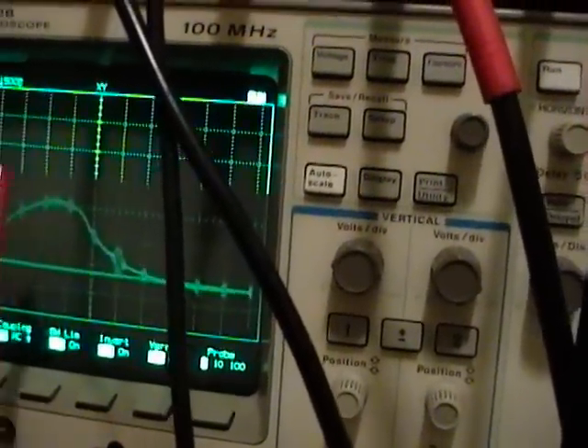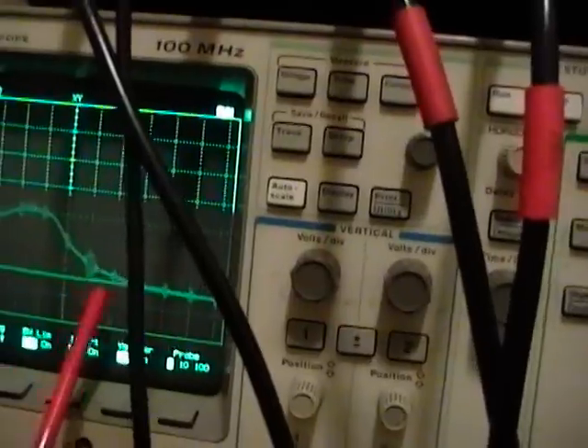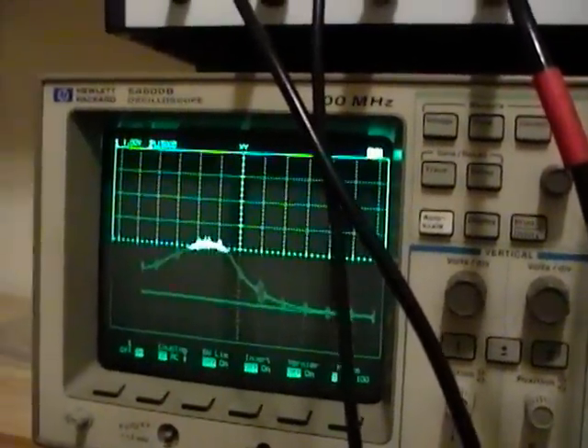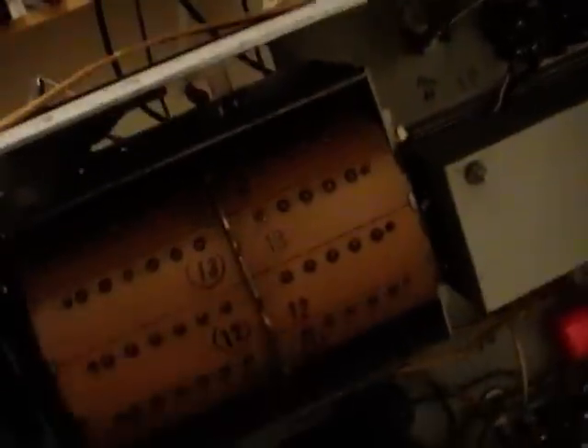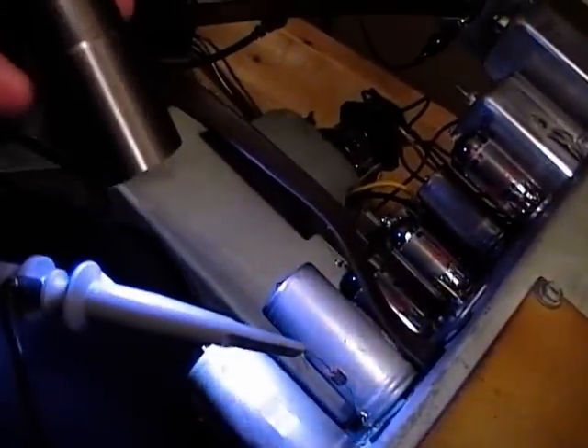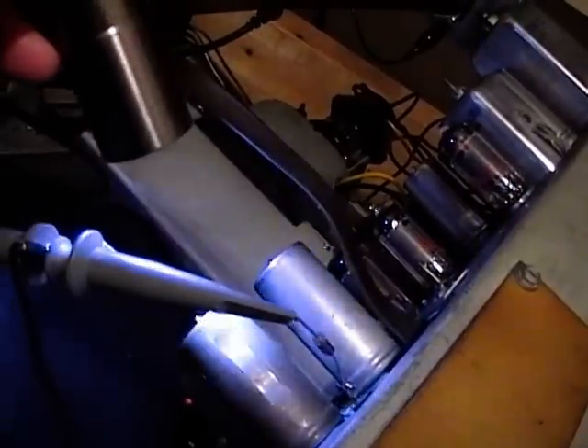What I'm going to try is adjusting it like I had a moment ago where I got a big peak on the sound carrier, and hook up that converter box. I'd expect to have pretty good sound but not so hot picture. Then I'm going to start poking around under the tuner and check some of the component values. I can take this drum out and check some of the resistors and so forth. I'm also going to try replacing the tubes — I'll do that first since it's the easiest thing, even though I tested these and put in new old stock tubes.